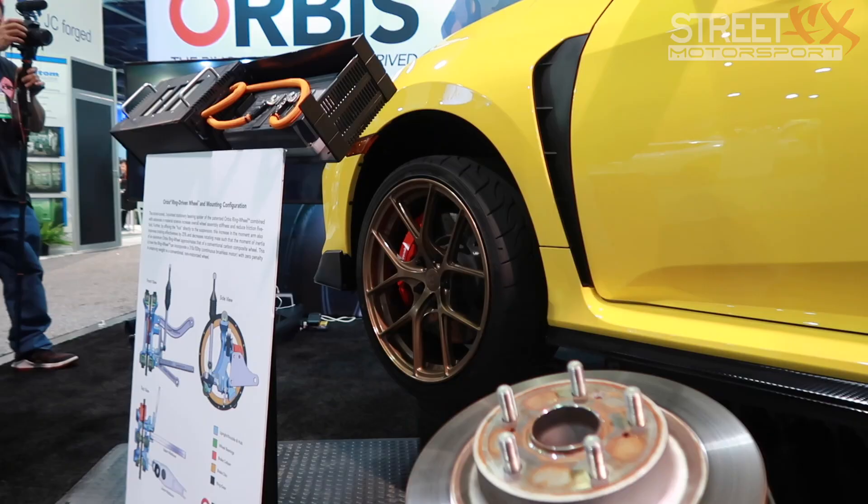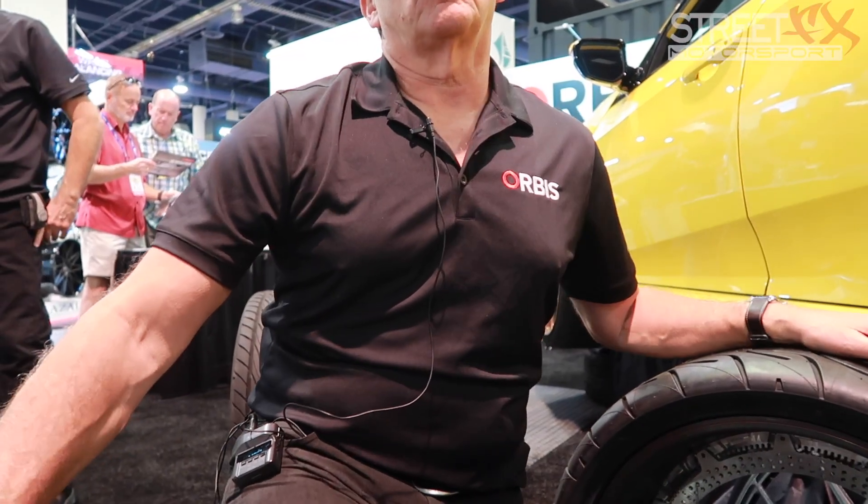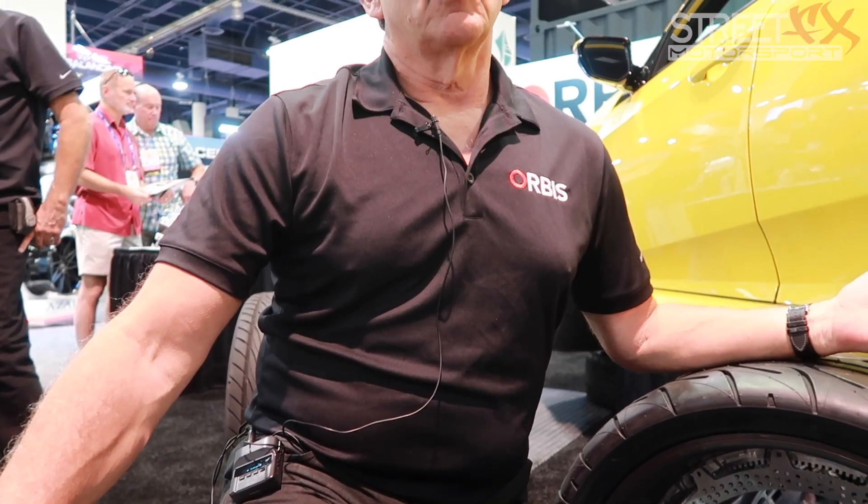In terms of battery packs, your choices are now more plentiful than ever before. You can buy refurbished Prius batteries for two thousand dollars and they bolt directly into the car — under the rear seats, inside the boot, there are all sorts of places to put the battery. In this particular instance, the battery added 175 pounds — about 80 kilos — to the car.